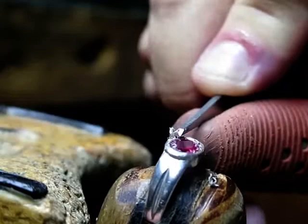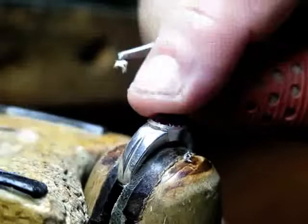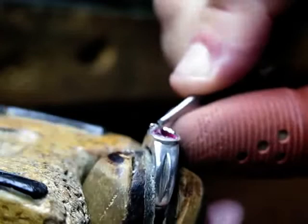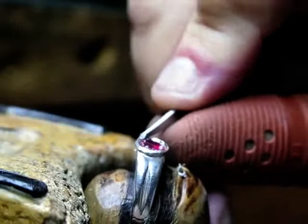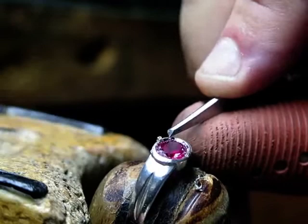I'm cutting all the way around. You can see my fingers really tight on the blade, and the bottom part of the blade is resting on my thumb. I'm going to even it out, because when the graver hits the facets it gives a bit of a shattered effect on the bezel wall. So on the second pass, you're just skimming the surface without digging in as much as on the first pass. What you're aiming for is a nice, complete, wide cut right from the facets of the stone to the topmost part of the bezel wall.